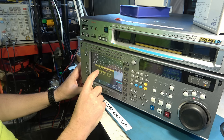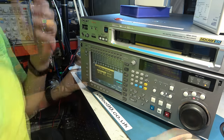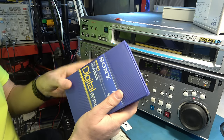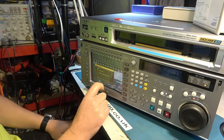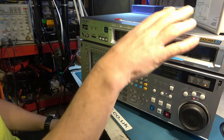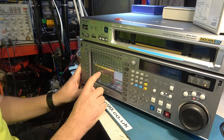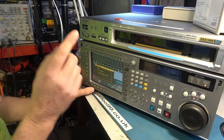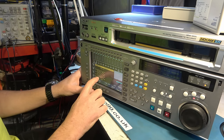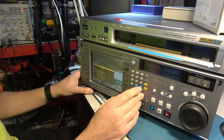Option info: we have the 5001-1 board and 5003, but not 5002. The 5002 is the digital Betacam processor board, so no point trying to play that tape - it won't play it. The 5001 is the format converter board which allows us to change the format of the output relative to the tape, which is extremely useful. The 5003 is the RGB processor board.